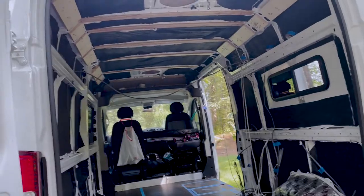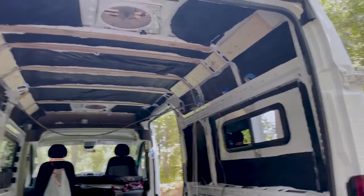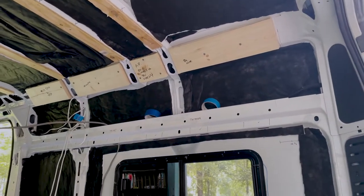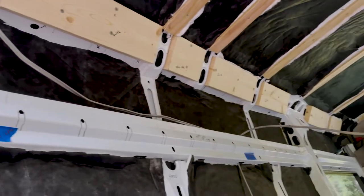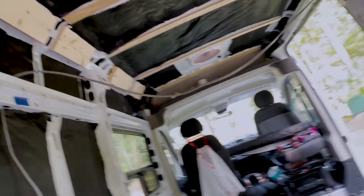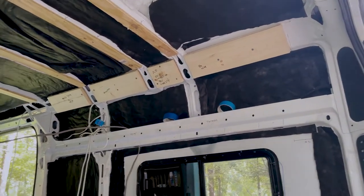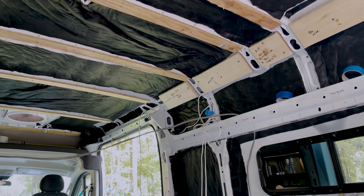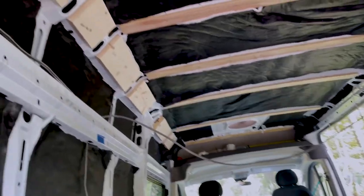As you saw on the time lapse, we have now put up the two by sixes. We labeled them — we've got Big Mike, Austin Powers, Og Dog, Yoda, Keith, Kathy, Mini Me, Dr. Evil, Betty, Billy. That's why we just grab our cut pieces, do our pilot holes, put our self-tapping screws in, and that's where we're at.